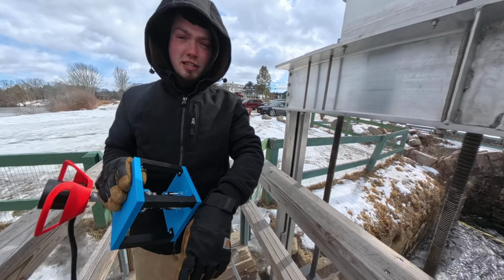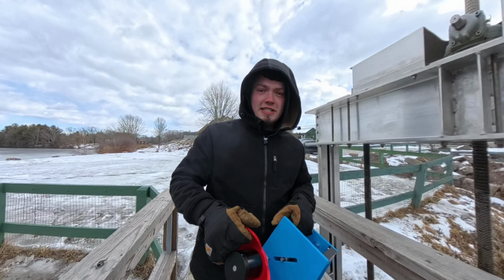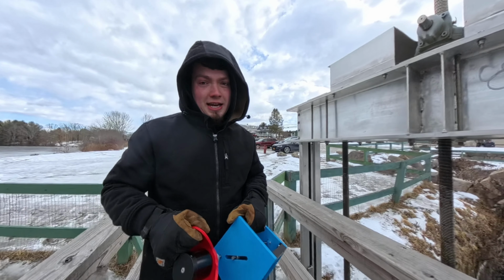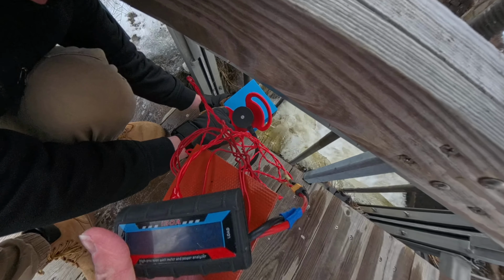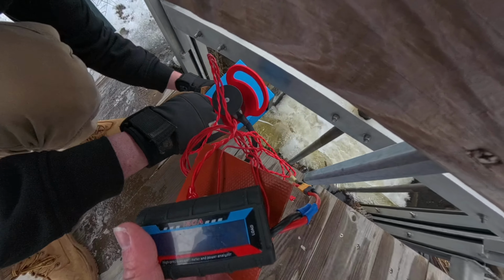So let's connect the third heater and see what kind of power we can get. All right, we've now got 3 of those heaters connected, and the reason I did this is they're rated for 25 watts each, so now I know we're not overpowering them. So let's get it kicked over and see if that made any difference at all. 75, 93, 76, 83, 85, 77.